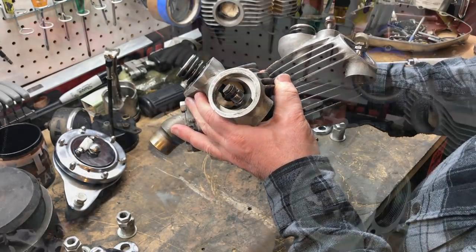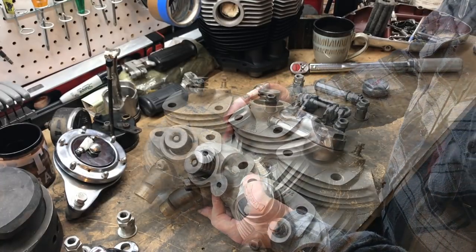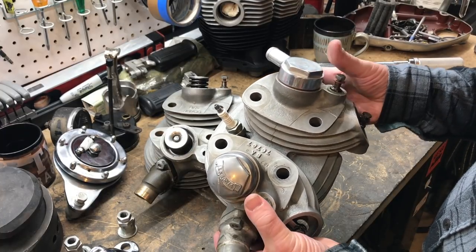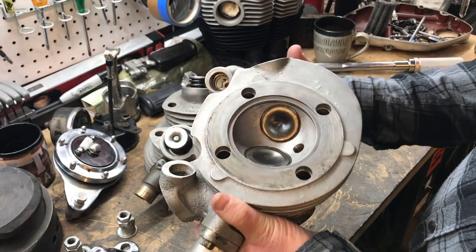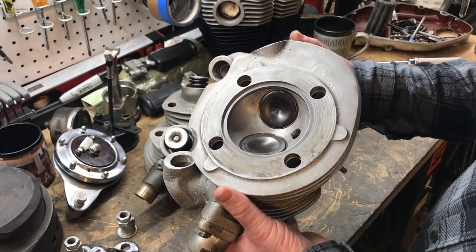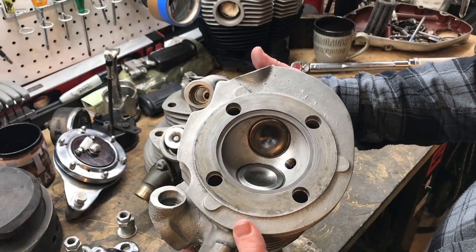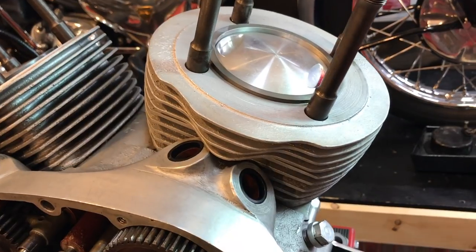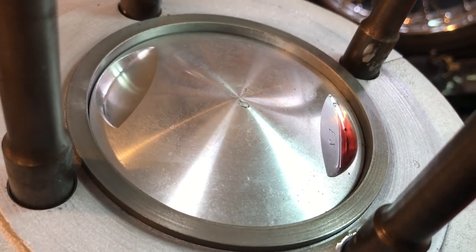The rocker mechanism actually looks brand new on the inside. Here we have the rear cylinder head — number one — again in great condition on the outside, and then looking on the inside: very, very nice and tidy. What looks like a brand new valve there on the inlet side; the exhaust valve looks like it's been reclaimed — decarbonised anyway. I don't see any signs of stress. The pistons are brand new and they're just beautiful — 40-over, which is what we established when we were using the borescope some time ago.